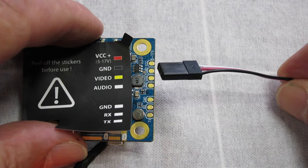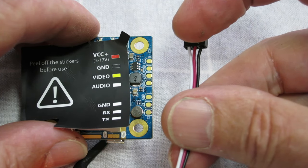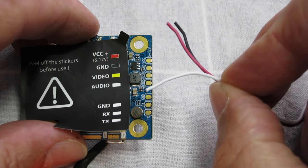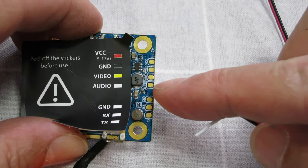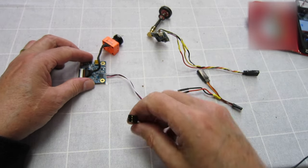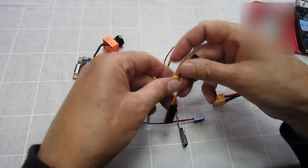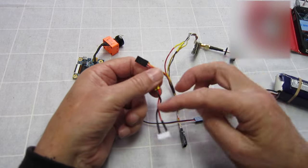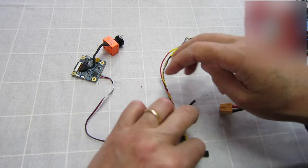So that I can integrate this with my transmitter and camera setup, I'm going to wire on this servo-style lead which will take video signal out to the transmitter and supply flight battery voltage to the board. I'll solder these on — red wire on the first pad, black wire on the second pad, white wire on the third pad. I won't have audio going through to the FPV. This is my typical FPV setup. There's my video transmitter with a female-style connector. I use a wire lead and swap out one of the female sides for a balance port of whatever battery I'm using to power it. That provides power to the camera and transmitter and passes the video signal through.